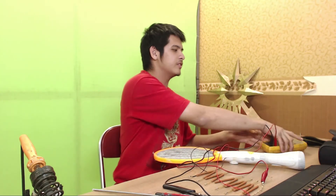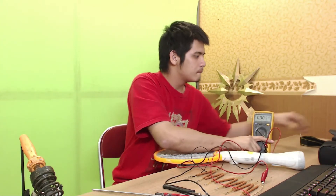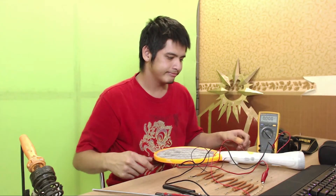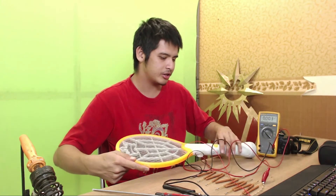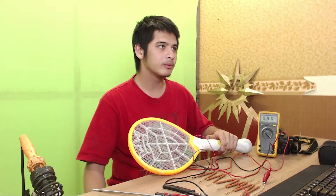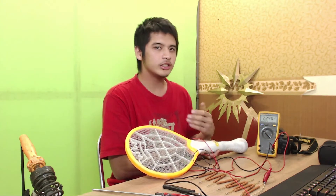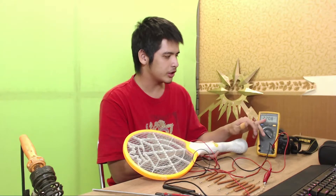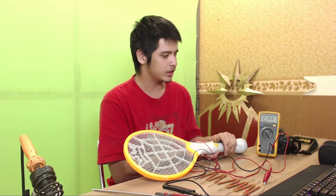It's basically a voltage divider. Camera to the rescue - I somehow lost my tripod so I have to use my webcam as the main video camera. What will happen if you push it? There it is - the ratio is 1000 to 1, which means 2.220 kilovolts. So that's 2200V. The baseline won't be perfectly accurate but this will do for most multimeters.